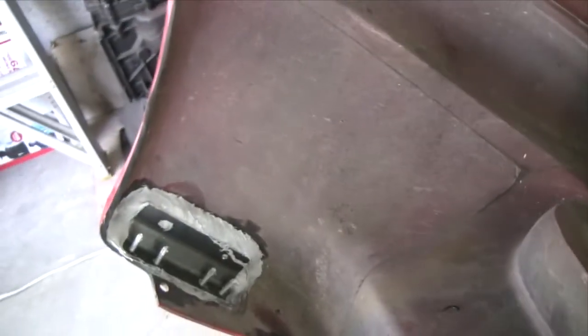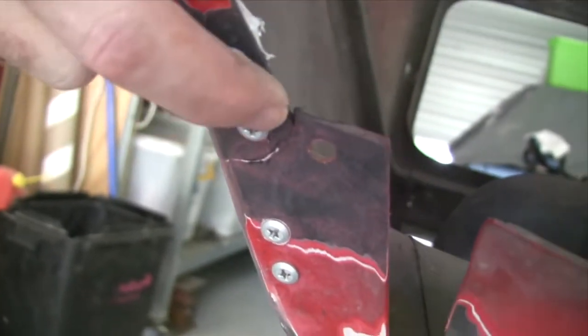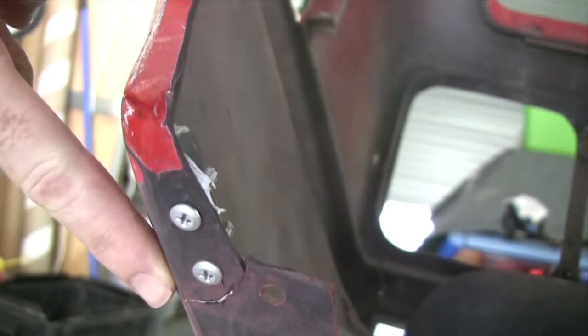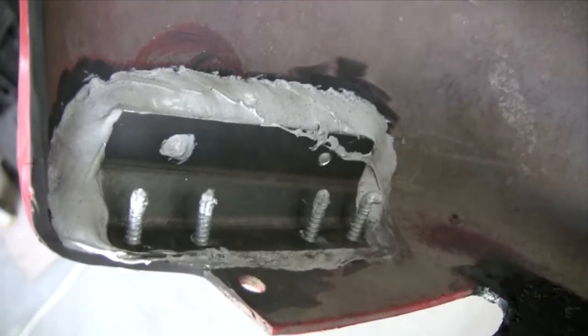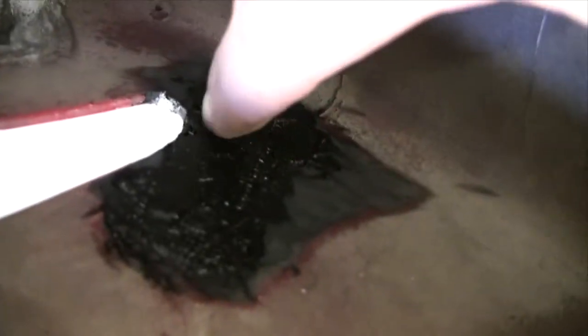So continuing with the repair work on the bumper bar, I made up that bracket to go in that corner. As you can see, it was cracked all the way through there, and this section here was out at an angle, so nothing would hold it back in. I didn't think the plastic repair may work there, but because it's under a lot of force, I gave it a bit of plastic repair there. There was a crack coming through this way on that one.